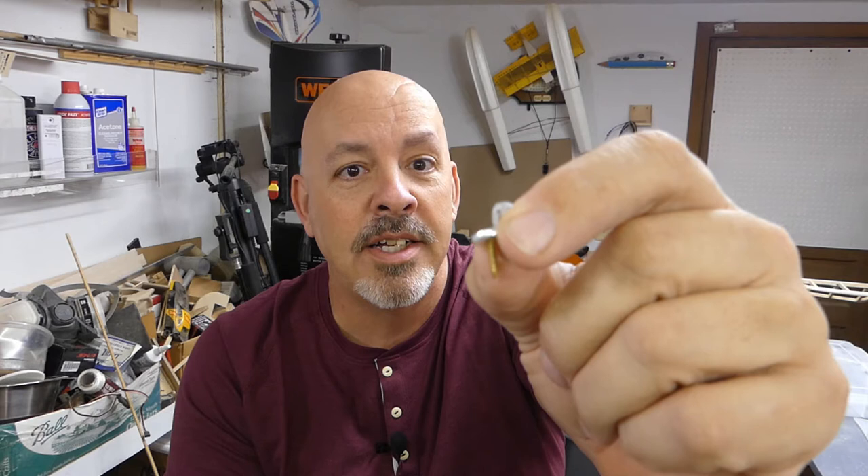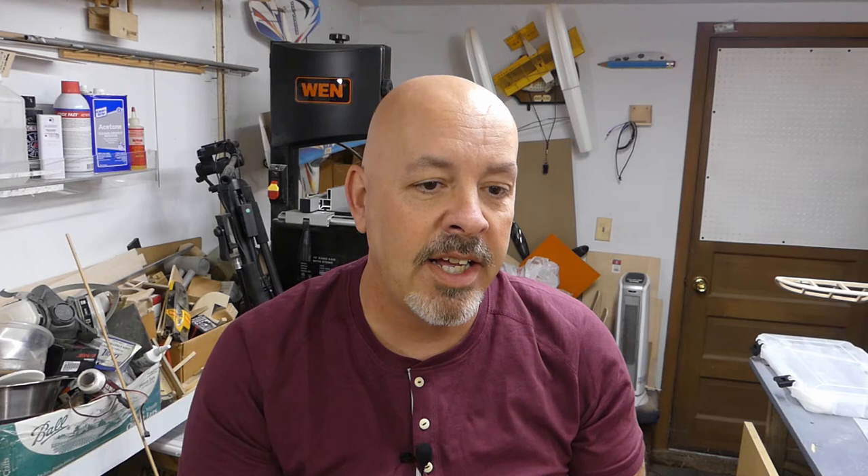I could tell you how I did it — it was very easy, but the tricky part was steadying it. It was in a vise but I didn't have it set up perfectly. You're just kind of going with it, getting it as close as you could by rotating the drill around at least two points, 90 degrees off, making sure the drill itself wasn't shifting side to side or fore-aft, then just running it down. I ran it straight down through the vise until the tip of the drill bumped the vise, took it out, tested it, and everything worked out great. So these are done.